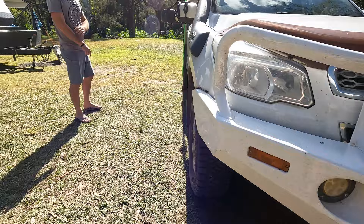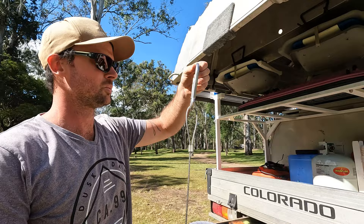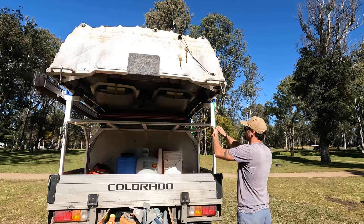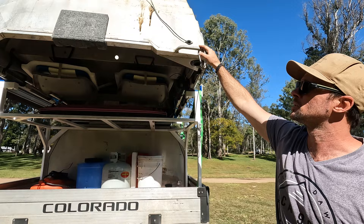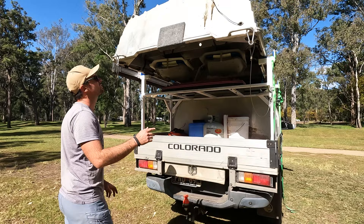For the rear we put the hangers on — just some wire hooked up to snap hooks — and these go onto the back. All they do is stop the boat from falling too quickly; they take the weight once it gets down low so the boat isn't scraping on the ground and it gives it a linkage point. Without these, the boat would come straight down and hit the ground, or roll over — you don't want to scrape the boat up.